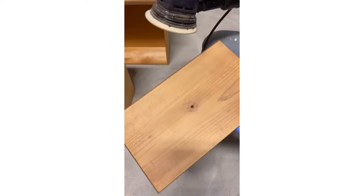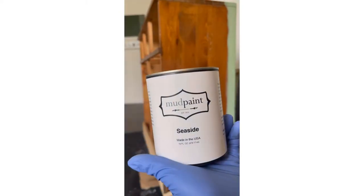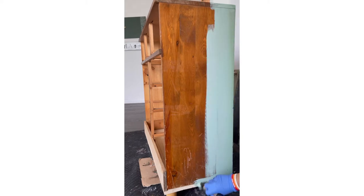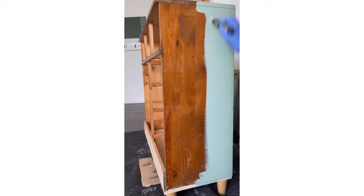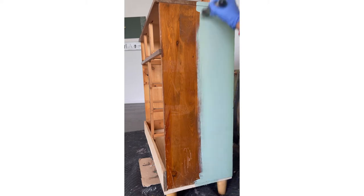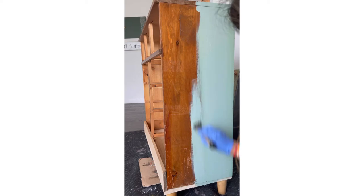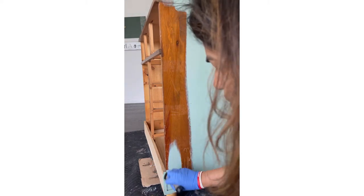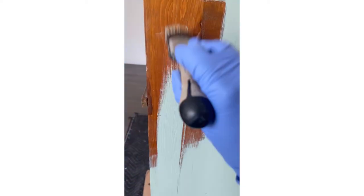The drawers are ready — now comes the painting part. I'm using Mud Paint Seaside, which is a very beautiful aqua blue color, to paint the entire body of this dresser. I sanded it down with 220 grit, wiped it clean with water, and painted right over it. I didn't use any primer because Mud Paint's adhesion is just amazing — one coat is enough to cover the wood grain.